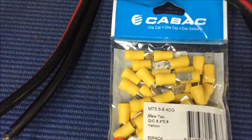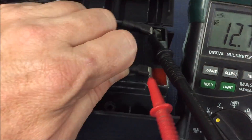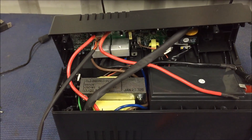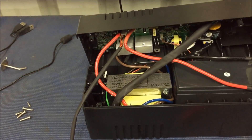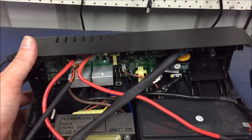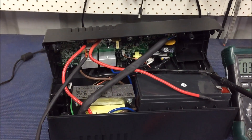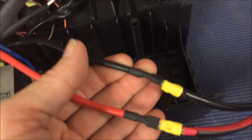I've got some cable terminal connectors - I'm just going to pull that off, terminal connect it and join it up. It's not going to be carrying a huge load - I measured about 35 watts AC this morning. Hopefully this has got enough to keep those 330 amp-hours floating. If not, I have a 100 watt panel and that old PWM charge controller to just keep the battery topped off.